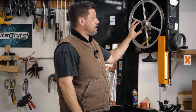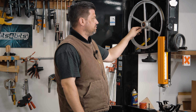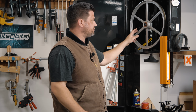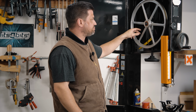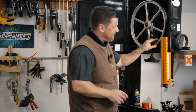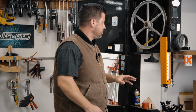One thing to think about while you're doing it is that your top wheel is your tension wheel, so be careful that the wobble side to side while it's not under tension doesn't throw you off. You want to check them and make sure that it doesn't always go to the same point. But as you can see, mine stops and spins freely without any strange extra motion towards the end. We've cleaned off our tires. Mine are going to need replacing probably in the next year or two.